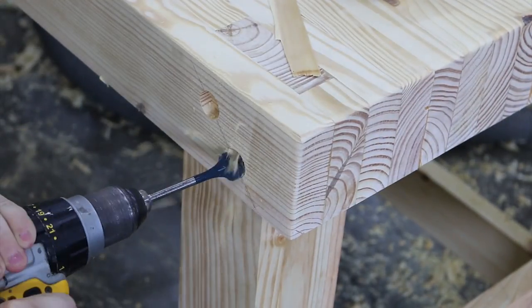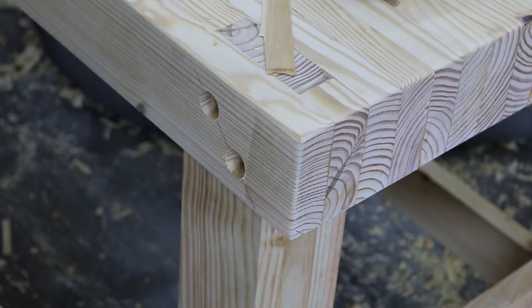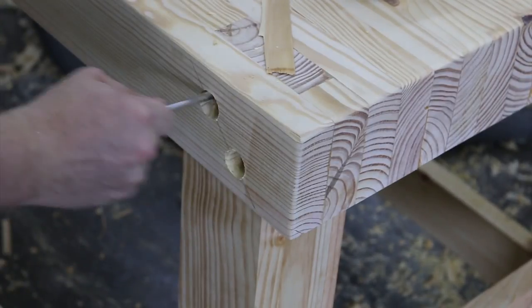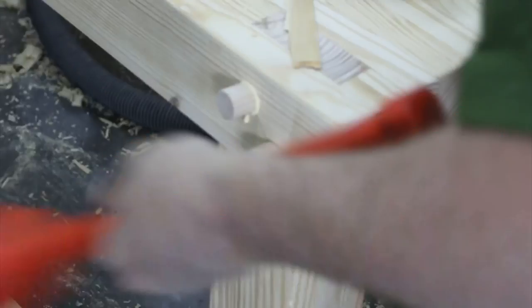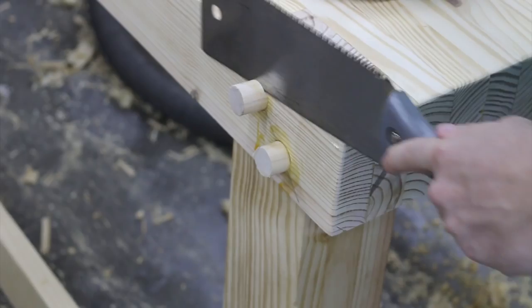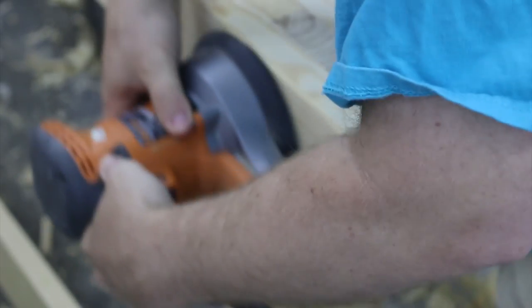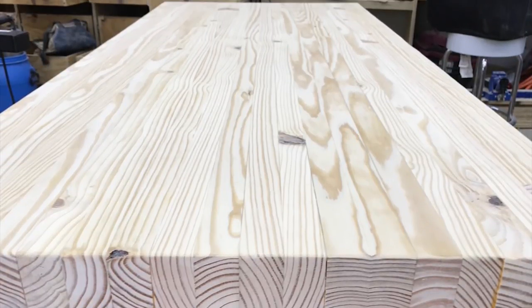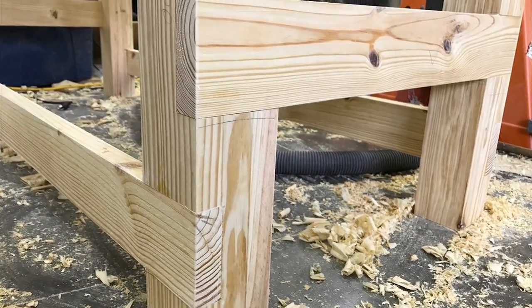At this point I was a little concerned about the strength of that joint — I'm not sure why, because it's going to be a pretty strong joint, but having to fill in that strip at the end made me uneasy. So I decided to add a couple of dowels into the joint just to make sure there was no way it was going to break. I used a spade bit to drill out the holes and then glued and hammered in the dowels to reinforce that joint.